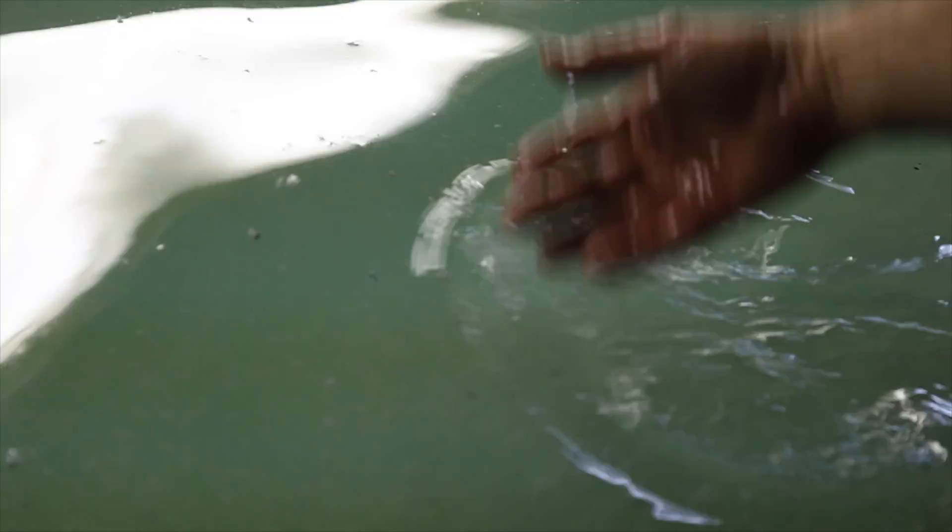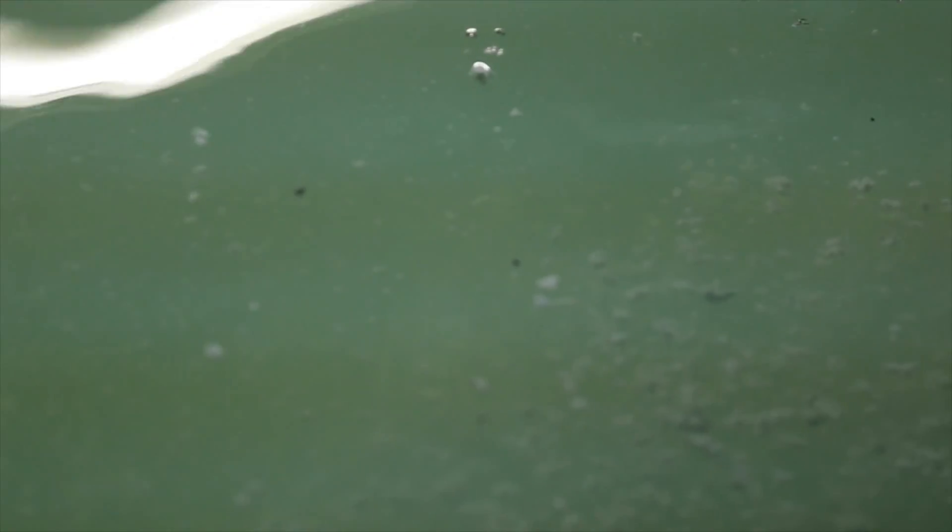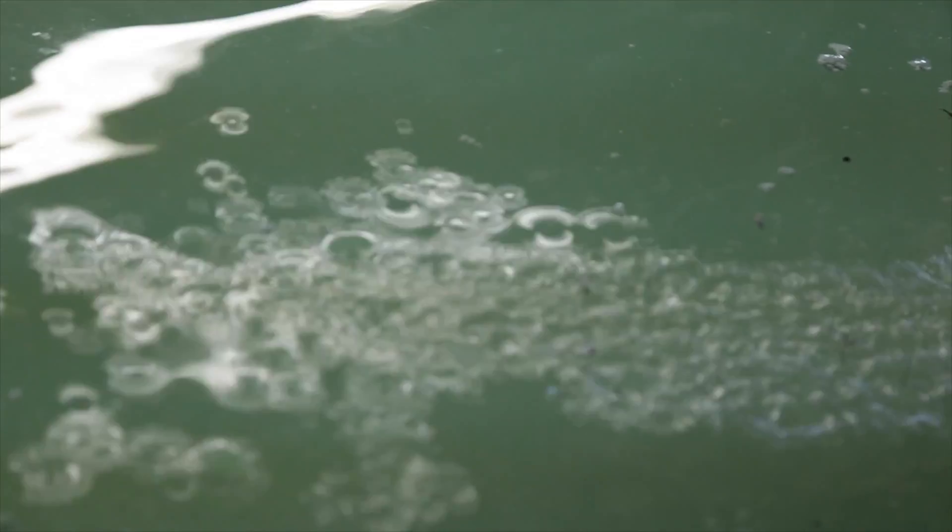This water contains the metal hydroxide particles. Metal hydroxides are the contaminants that come during our processing. Our entire wastewater treatment process is designed to remove these metal hydroxide particles from the water, so we let clean water be released to the city public-owned treatment works, and the metal hydroxides are concentrated into the sludge.